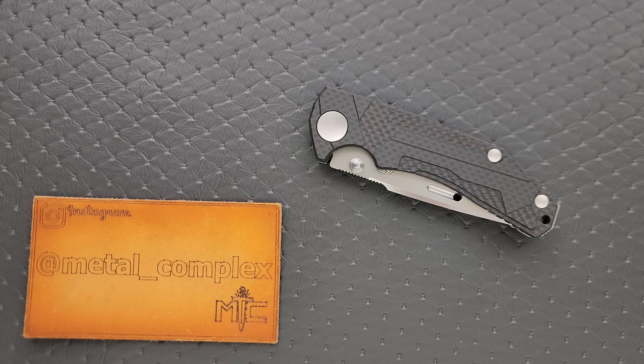It is ridiculously sharp, and it will stay ridiculously sharp because of the edge stability benefits you get with a convex grind instead of a flat or hollow grind. ZDP-189 has incredible potential edge retention, but it can achieve much higher levels of Rockwell hardness. If you're wondering why don't we just harden M390 to 67 — because you end up with something that would shatter like glass. But ZDP-189 still has really, really great toughness. It doesn't have nearly the same level of corrosion resistance, because composition is a multi-directional teeter-totter.